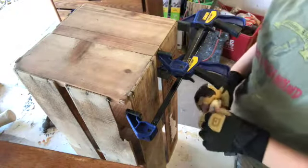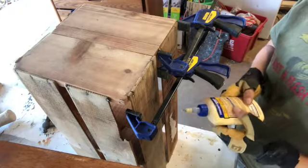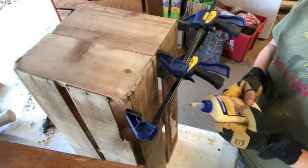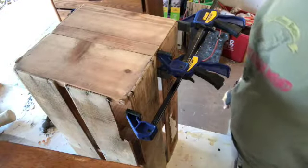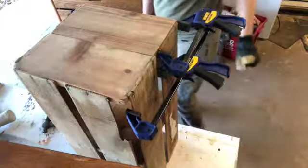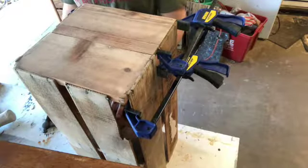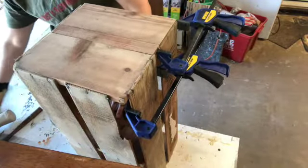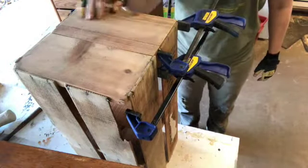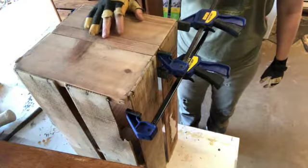Finish up sanding, and polyurethane. I am putting this in a kitchen, so given the way kitchens seem to gather greasy dust, I don't really want to have just raw wood in there, and this is the rawest of raw wood, so it makes it hard to dust and clean. So we'll polyurethane the heck out of this thing, and that'll be next.